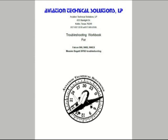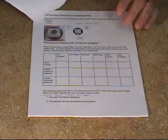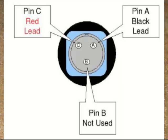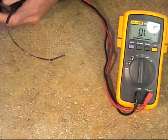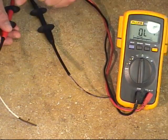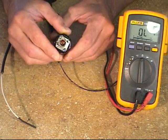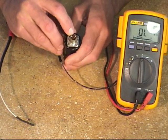There's a troubleshooting worksheet available at www.av-ts.com. We'll go right into troubleshooting the resistance on the TAC transducer. We'll pay careful attention to get the polarity correct on the voltmeter — it will become important as we move along. On the meter, make sure the red lead plugged into positive goes to the red test lead so you can keep your polarity straight. We'll double-check our polarity on the TAC generator.